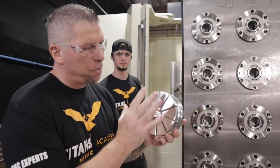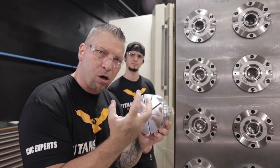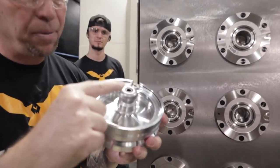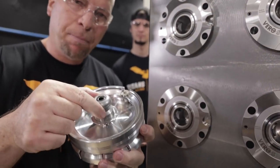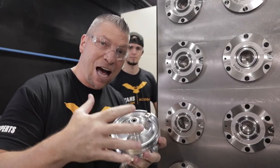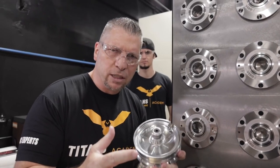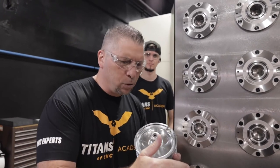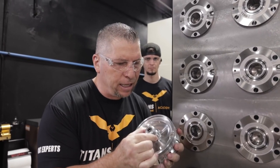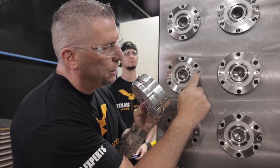So this is a fixture membrane from Schunk. It's how we clamp onto round parts on a mill, right? Now check this out. You have a clamping pin down here. This clamping pin is genius because you can take this pin or two pins or five or 10 pins, right? And you can hook it to pretty much any type of work holding. So Schunk vices, custom tombstones, membranes like this, boom, you put the clamping pin in. And then you have a locating pin right here that engages right here, okay?